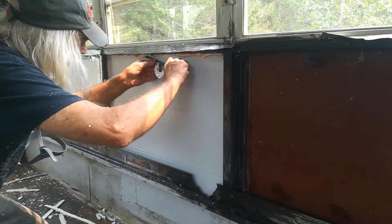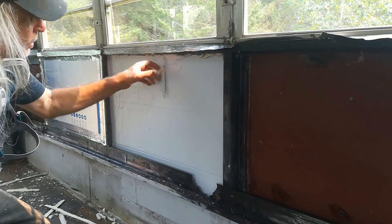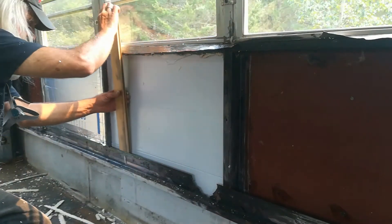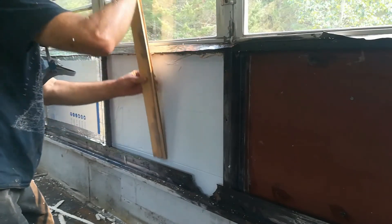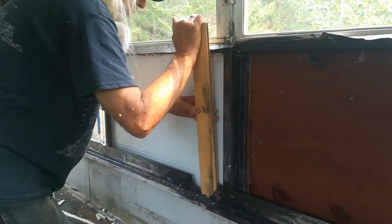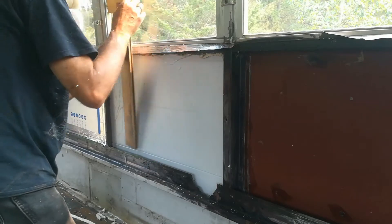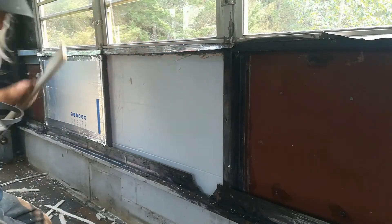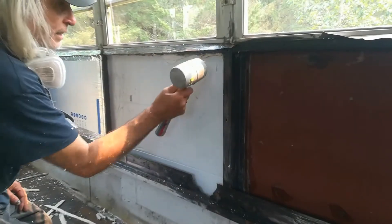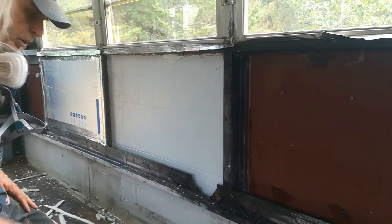There's a little bit of excess here so it's not overlapping and won't get in the way of the other sheet. I'm going to take the board and push it in, making sure it seats into the nails, leaving enough room for the next sheet. There we go — nicely seated. You've got R5 already; one more sheet gives you R10. We're going to cut that right now.